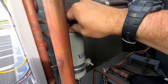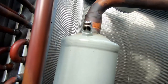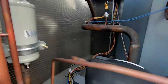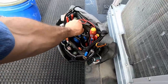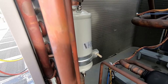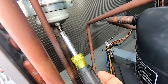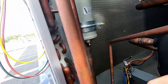Keep in mind these caps are really just for dust - unless you're using a brass cap, these are not meant to seal it. This one right here same way, so that could have been one of our other leaks. Make sure those cores are flush or seated. They've got a torque wrench you can use but generally a little common sense and two fingers works. Look at that - I just tightened it up and it's completely flush now. Same thing with this one - almost one and a quarter turns and it's flush.